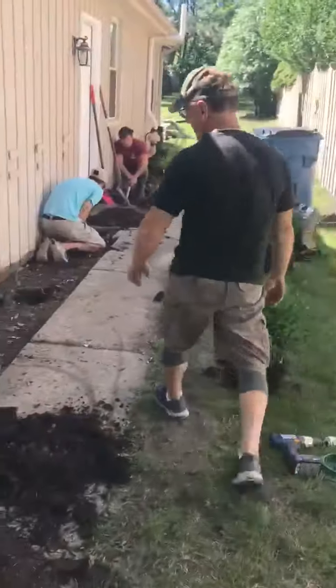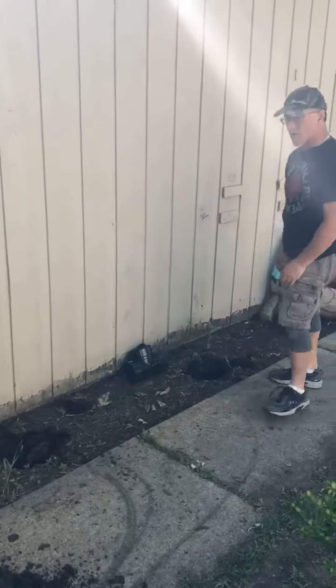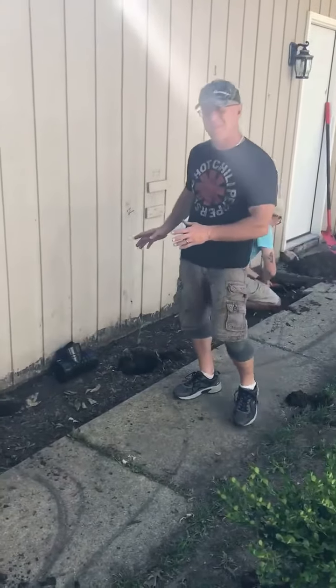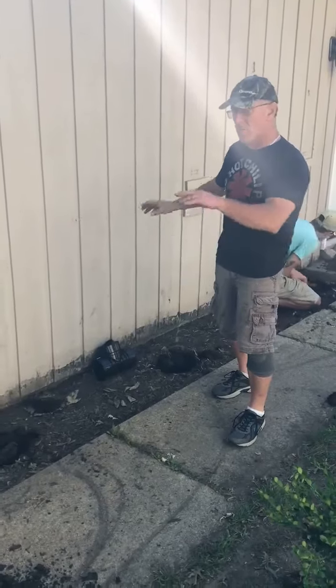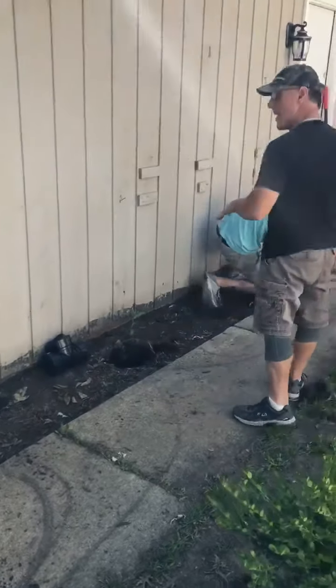You can see right here that the water is pooling up against the siding. So we're going to go ahead and install some yard drains and move that water over to a culvert that goes out to the street. We're going to put a couple of these in throughout the backyard here.